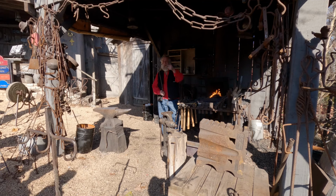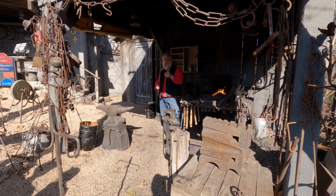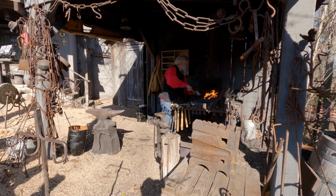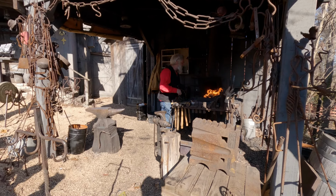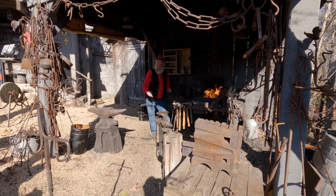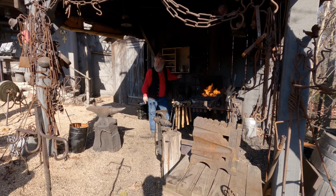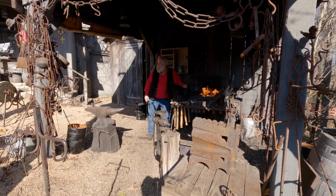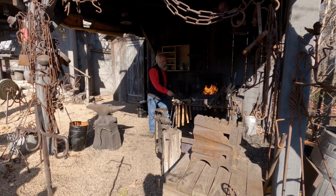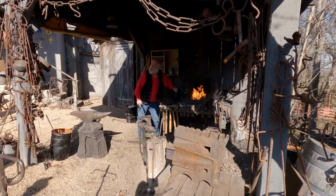Now the hard part. This has to be looped through here. I'm making a campfire tripod. We do it in two different sizes. Big one like this here that's got the pot hanging from it. Each leg is made from a 5-foot piece of 1/2-inch square steel. And then we got the smaller one here. This is 40 inches of 3/8 inch.